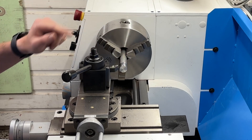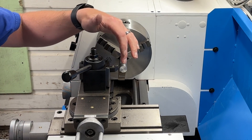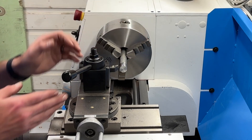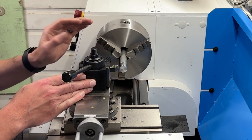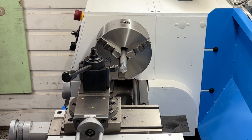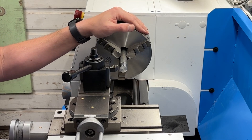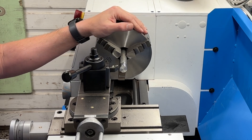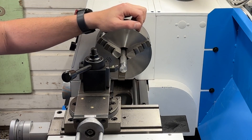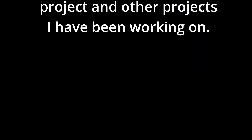To the keen-eyed among you, you may notice the quick change tool post is at quite an angle — I did that just to easily face and turn this piece of aluminum without changing tools. Normally I would use the chuck face to get it perfectly lined up so everything travels parallel, but for this simple setup I wanted to do it all with one tool. I hope that gives you a little more information on this PM-1228. I'll be making parts and doing projects with this, and I'm sure I'll find some upgrades — there will be future videos involving this lathe. If you have questions, put them in the comments and I'll do my best to answer them. If you like what you've seen, please click like, and if you'd like to see more, please subscribe. Thanks for watching.